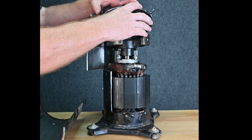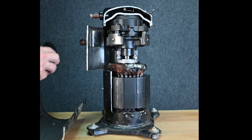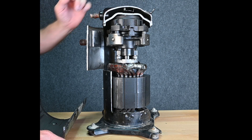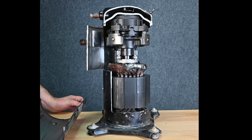If we take the very top shell apart, here we can see what's happening. This is the very top — this is the discharge side. So all of this top section here is high pressure, high temperature, superheated vapor. So all of this is a hot gas. If you're going to touch the top of the compressor, it's going to be very hot because that's your discharge temperature.